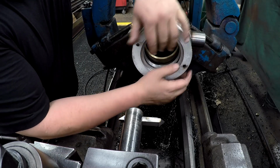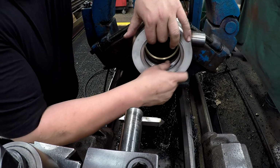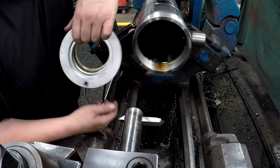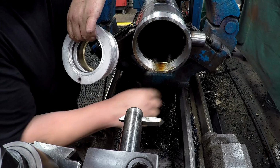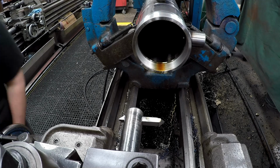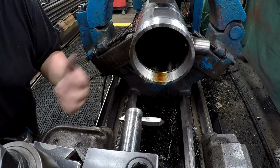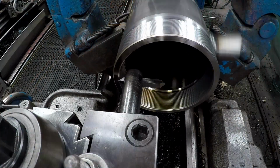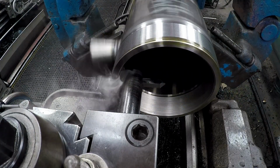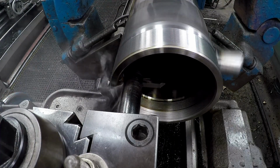It's almost there. It's starting to get tight there, but I can tell it's really close. By the way, I don't have no magic number. I go by how the thread looks and how it fits. I know I want it to fit good. So we'll go another 5 thousandths on the dial, because the pressure is still gonna be taking a cut even if I didn't dial it in any further. Yeah, that's still quite a bit of metal coming out of there, even with just 5 thousandths cut there.